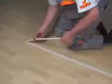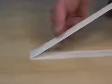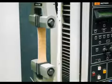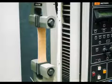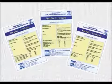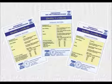After 10 minutes, the cold welding liquid on the masking tape should be dry, so the masking tape can be removed, leaving behind a strong and nearly invisible seam. The quality of the WM PVC cold welding technique has been proven by extensive testing. We have quality certificates from the independent testing institute IFPÜF Institut für Bau- und Fußbodentechnik Koblenz, Germany. Details concerning the results are available by request.